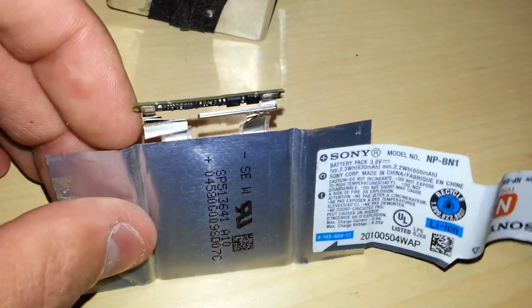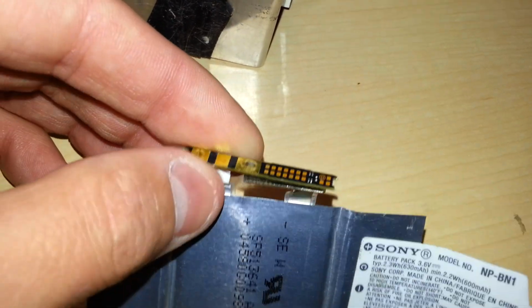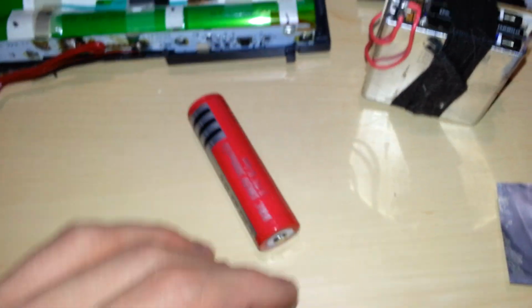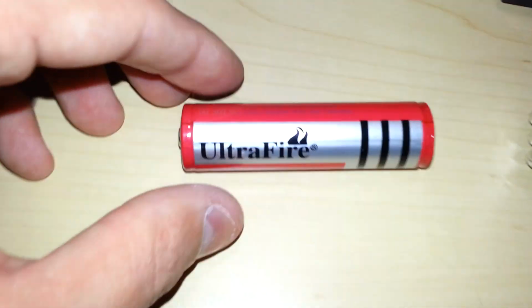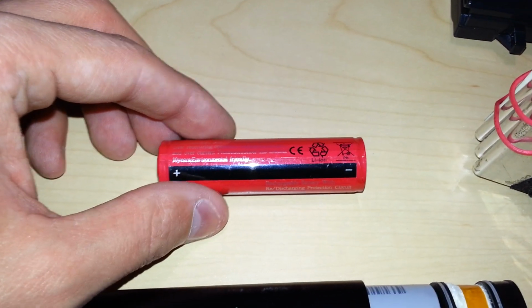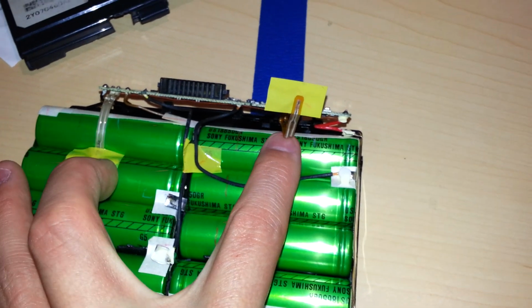Here's a Sony camera battery. You can see these are small circuit boards. They have thermal protection at the worst case scenario, and then they have the charge circuit board. This is over voltage and under voltage protection, both on charge and drain. I take apart these batteries because I use them in a kit for amateur radio field operation or whatever, and because I do work with one battery company on some of their stuff, but we use them primarily in LED flashlights as consumers nowadays. I just take it to the advanced level, and I wanted to show this one's got two sensors connected on separate points of the battery. So thermal's a big issue on lithium batteries.